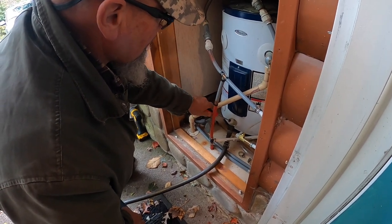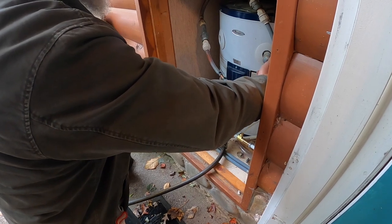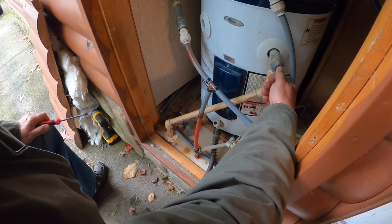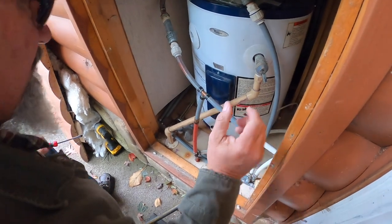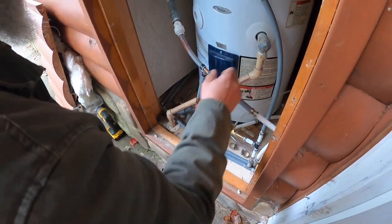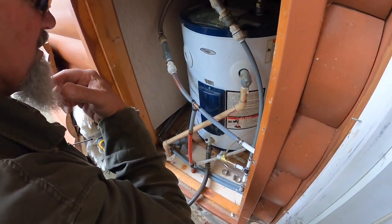Anyway, we're going to divert things here, and then we're going to detach the sink in the kitchen. So you hit this pop-off valve? Yeah. What that does is it lets air in to let the water out. And where's that draining to, do we know? This is just an air vent. Oh. Open the hot water side of your kitchen sink? Kitchen sink.